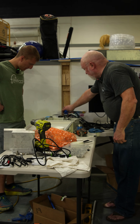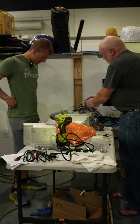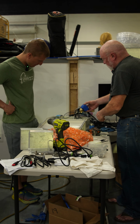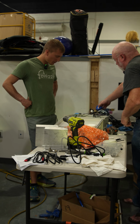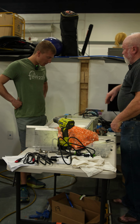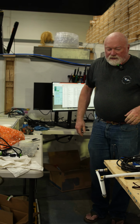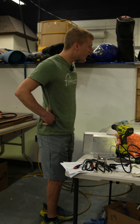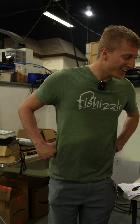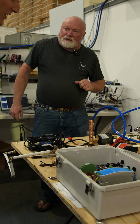These are ball valves. This is the flush water one, and it's normally closed. When it's energized, it'll open. This is a flow meter, so you can see how much water you flushed out, in gallons. And this will all display on your chart plotter? Yeah, it's right here. So here's another flow meter, and that's water made.